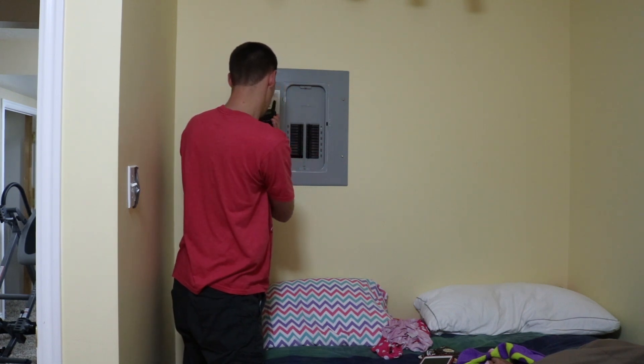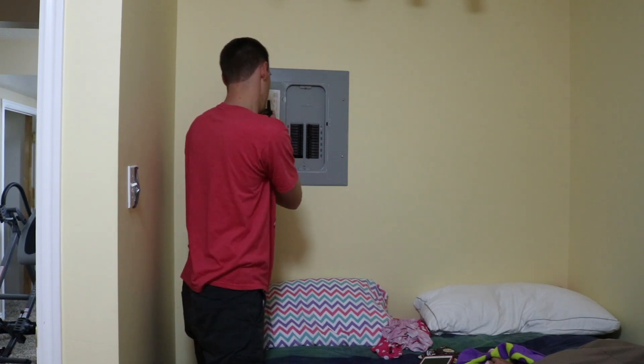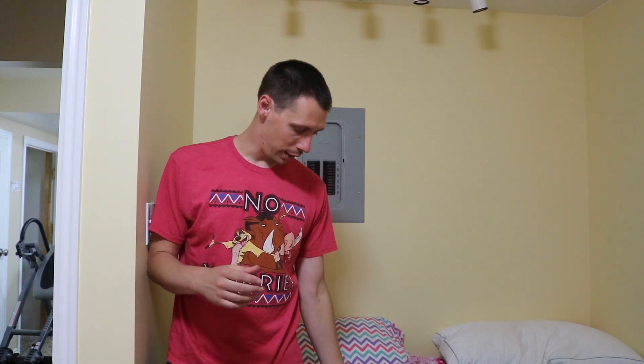It all turned off — lights and the ceiling light. I'll turn it back on now. So after going through room by room with my daughter, putting up with some of her shenanigans on the walkie talkie, and her getting bored and me deciding to finish it myself, I have established that two of these breakers are not being used. It's those two I mentioned earlier — the dedicated modem and dedicated computer. The modem one goes to an outlet in my furnace room, and that is all I can find. The computer one, I couldn't find anything tied to it. The method is: go through every room, turn everything on, plug a nightlight into every outlet, start shutting off breakers, and someone radios you and says 'the light just turned off' — then you mark that you need to keep that breaker. I consolidated a big list: these are my breakers being used, these are the ones that are not.